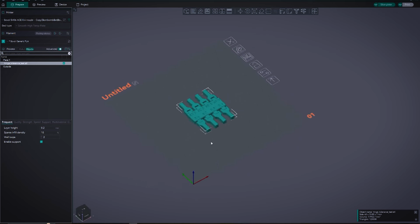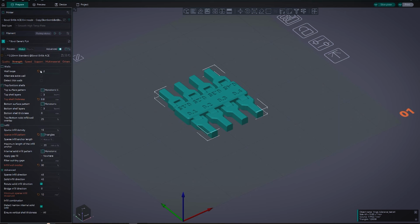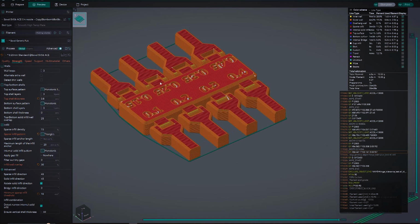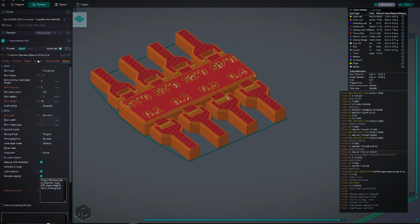In models such as the previous one, I had mentioned that parts fit together just fine, but I realized that there's a bit of a problem with that when you're not the designer of those parts, so you're not entirely aware of what kind of clearances were built into them. So I'll print one of these clearance tests, and it still doesn't necessarily mean that the parts themselves will be dimensionally accurate, but without getting too technical, it will still give us a pretty good idea of what the printer is capable of in terms of printing parts that either fit together or perhaps are print-in-place parts, where these kinds of clearances really come into play.